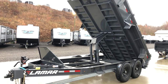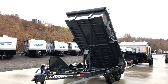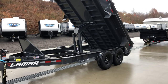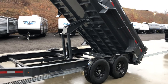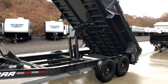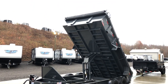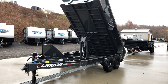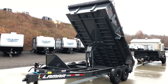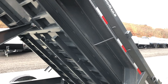If you check our other videos, you'll notice we do have a 516 scissor demoing what it'll do. This particular unit, assuming you're not massively overloaded on the tongue, will do roughly a ton to a ton and a half more than what it's legally able to do — shouldn't have any problems for a high duty cycle user. We did find that if you are extremely tongue-heavy, it will reduce your payload upward of a ton, which still allows you to lift the legal payload of the trailer even being a little overloaded tongue-heavy. Cross members are 12-inch on center, nestled bed frame. There's also a prop in the fender for a little support there.